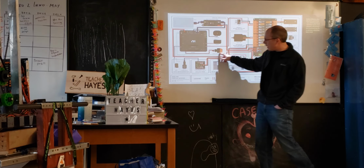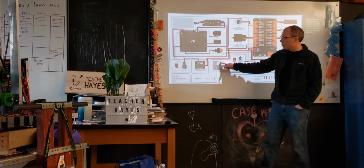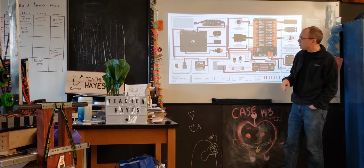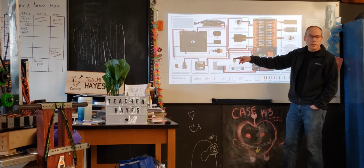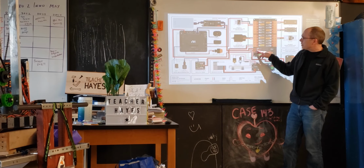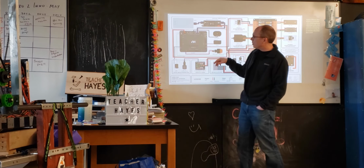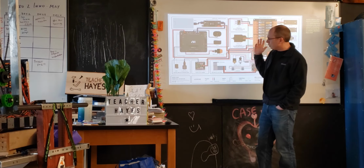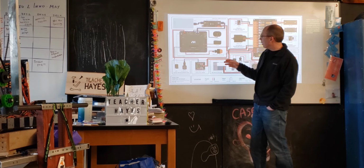In some cases, you can have regulated power. This might be converting power from 12 volts to 5 volts, 3 volts, or other voltages that might be required for other parts in the system. We didn't have that. I don't think we had any of those this year. We've had that in the past. And then, of course, power to power the RoboRIO. We'll talk about each of these components in more detail. So this is going to the RoboRIO. The RoboRIO will power several other things as well, and it'll also have control signals across the different things.